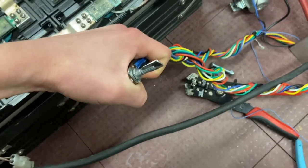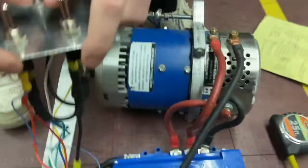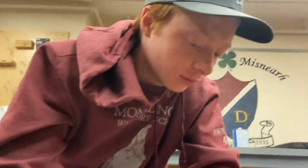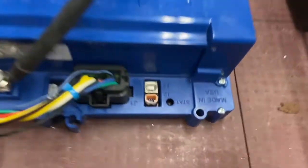The speed controller is flashing error code: two green blinks and six red blinks, which means low throttle under-range. There's a wire for that on pin eight but it doesn't look bad there. I'm holding our new throttle — this is just temporary, we have another one coming in the mail. These are zero-to-5000-ohm potentiometers. Ben cleaned up the wiring and pulled apart the pin that connects the throttle — that's where we saw the smoke coming from. Let's give it a test. Oh my goodness, let's go!